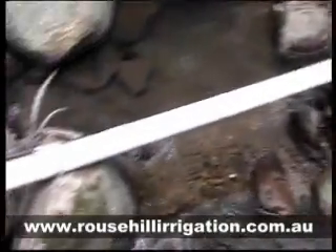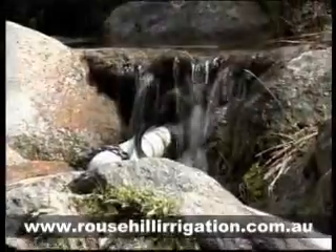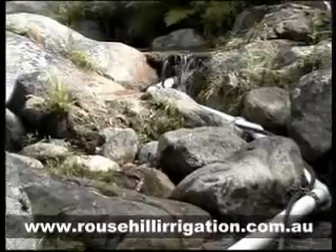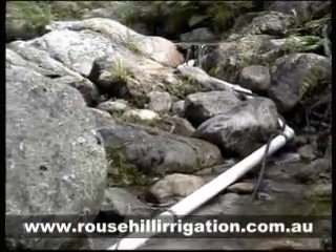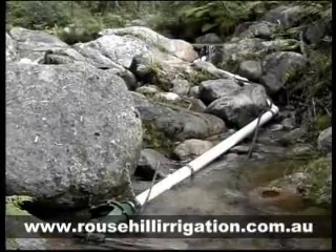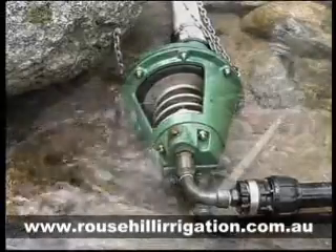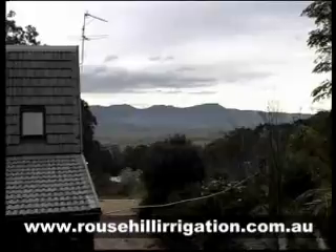Because the Glockeman pump needs only a small fall, it can be installed virtually anywhere. No need for long straight drive tubes — plastic tube with 30, 45 or 90 degree elbows can be used to suit your site. If your site has a large river, position your pump out of harm's way and secure your pump and the drive tubes firmly. Using the very small fall, the Glockeman will quietly pump continuously to supply your property, which may be as high as 200 metres above the water supply.